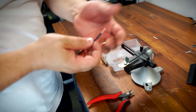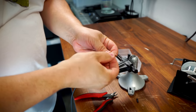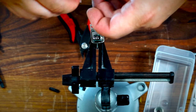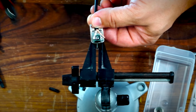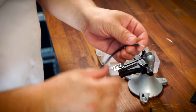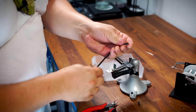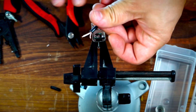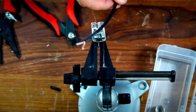I might want to take off a tiny bit more just to make sure I have plenty. Now I'm going to braid this wire. I pre-measure to make sure I'm looking good here — it looks like I'm slightly long, so I'll cut off the pieces that are a little too long. I'm going to take off the slightest bit on the side going to the tip because I want to keep as much of the clear insulation around it as possible. The idea is that the insulation is going to protect me from a short, so I don't have any risk of the shield coming over and touching it.